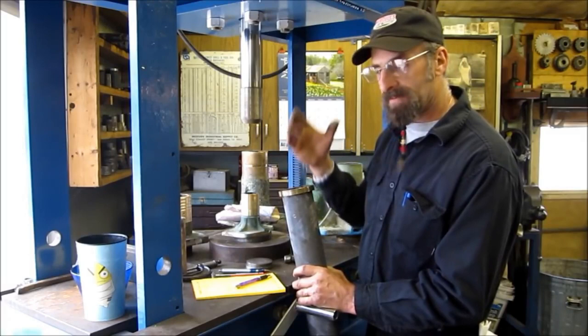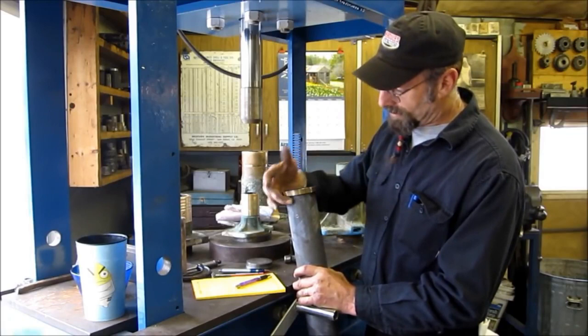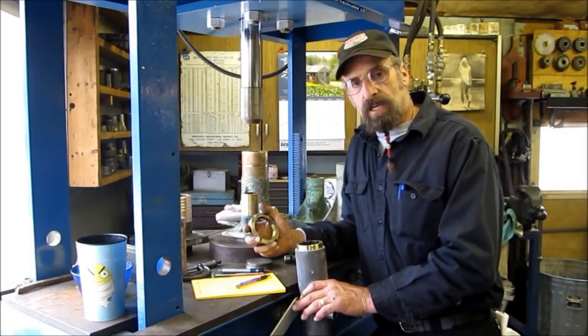I have the tools — the wrench that fits on here, the drivers that put it in, the sleeves that help pull it out. Basically this was developed so that on the glass tube, a fragile system, you can pull your two dimpled set screws out and crank the nut and draw the bearing out. It is now such a great tool because the guy can change out his bearing with the shaft left in place.